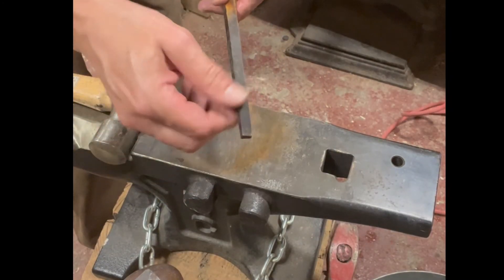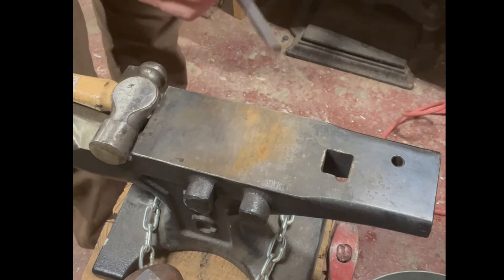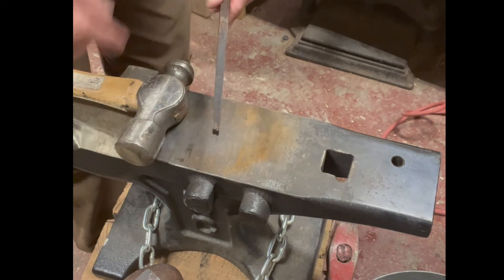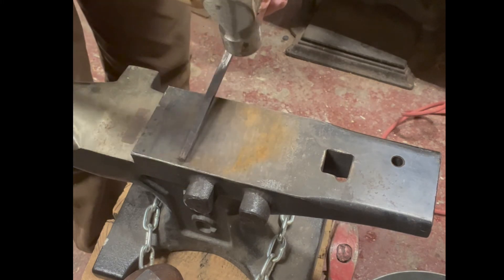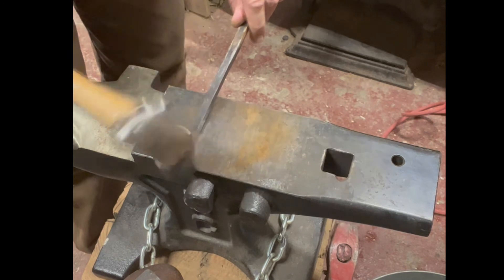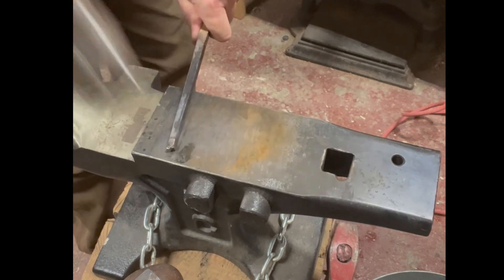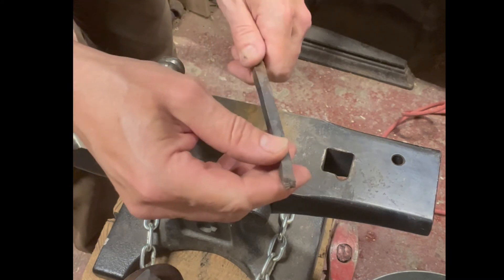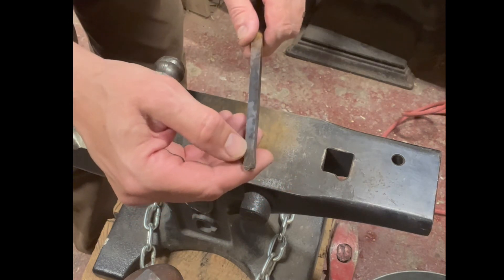Here's the other thing I've been really struggling with: bronze is not steel, so I haven't really known what to listen for. I'm going to try to flange this tip out — I'm trying to forge it out to make the cutting edge — and it's going to kind of make a thud, and then it's going to start ringing. I don't know if you can see, but it's starting to get kind of shiny there. That means that it's work hardened and you should stop hitting it.